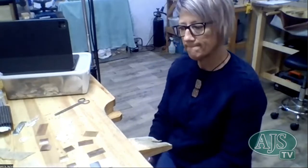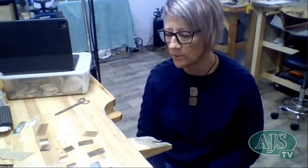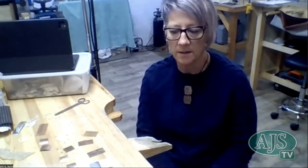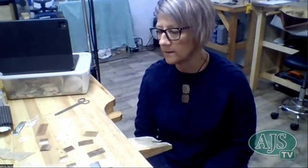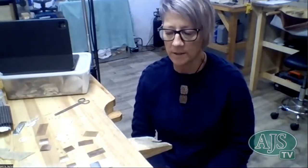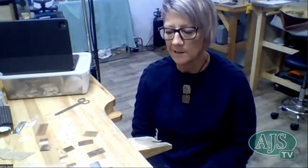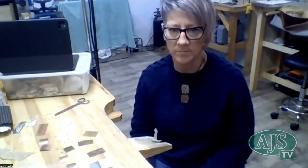So Tinica asked, was the metal annealed before putting it through the mill? And you said yes. Yeah, very important to anneal the metal before you put it through. I traditionally use nothing really thicker than 0.8. You still have to anneal the metal. I just think winding it up too tight is not good for the mill. If you can use a thinner metal, then it's best to do that than trying to force something thicker through and having to add so much pressure for it to imprint. There's no rule of thumb that says you have to use 0.8 or thinner, but it's just maybe a little bit easier and gentler.